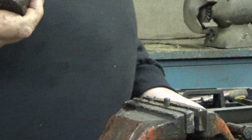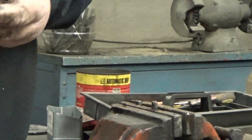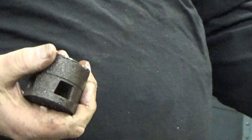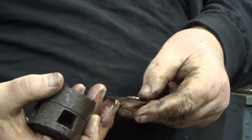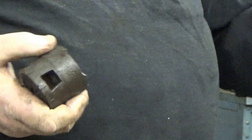I'm not sure which one was the good one, but as I look at this, it has a very high defined ridge — I'm confident in this valve. This valve disc, I'm not confident in. Once again, we've got a lot of rust and dirt. We have another old style spring, so we will replace that. When we go back together, I'll show you the little trick to putting these together — keep the same parts all together. And that's heading to the parts washer.